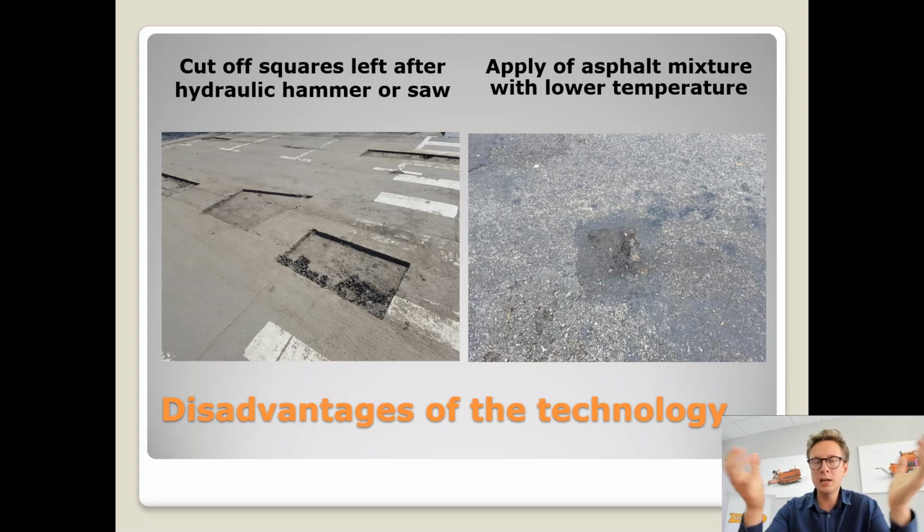Within the pothole patching, the repair is ready to be open for the traffic after 5 minutes, after 3 minutes, immediately after the repair is done. So it's just pretty much more economical. One team of 4 to 5 people, working by the standard technology of hot asphalt mixture, will provide 50 to 80 square meters per day. And with the blow patching technology, when you can have just one operator, you may provide even 150 square meters per day. So imagine what saving of the costs is done.